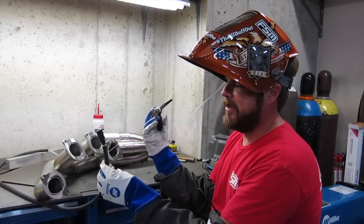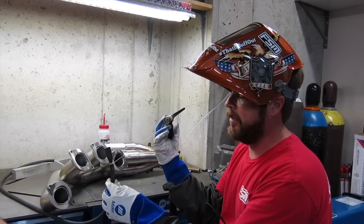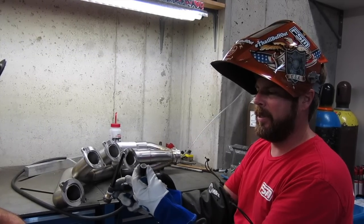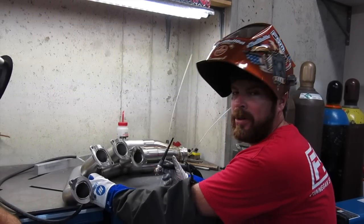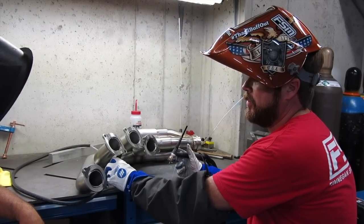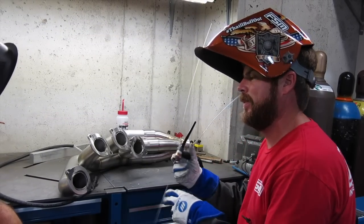We've increased the size of our purge line. It's just a piece of rubber fuel line, I think 3/8, and it's sitting over an air tool fitting with a piece of tubing taped to the end of that. Basically what we did was we made a bigger cup, and Dave's gonna put this bigger cup with argon flowing through it right where I'm welding, and he's gonna run it between the flange and the tube everywhere I'm welding. So he's gonna purge the backside of this without me putting gas through this.